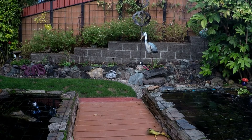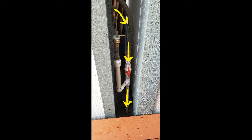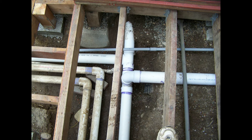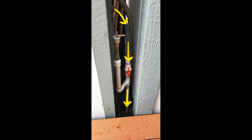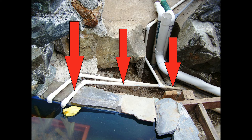If you look carefully, you can actually see them on top of that little brick wall. Now let's talk about how to make these independent adapters work. On my koi pond, I have a couple of rain barrels. I collect the water off of the roof and it fills both barrels, giving me 100 gallons of reserved water for the koi pond during hot days. Once the rain barrels are full, the overflow water will come out of this tube and through this valve, traveling through an extensive set of plumbing for my koi pond, then eventually being discharged into the koi pond itself. Once the koi pond is topped off, the overflow goes through a drain and back into the storm system. Since the plumbing is underneath the deck, it has to rise up to actually get to the top of the koi pond, meaning there's water stored in that pipe — and it's not even buried, it's simply under the deck, so it's very susceptible to freezing.